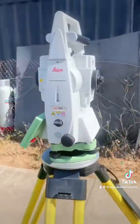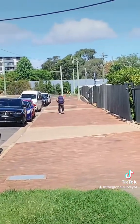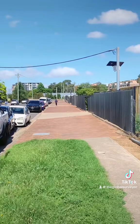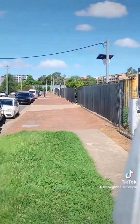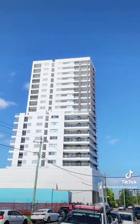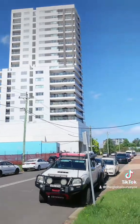To do that, we're going to have a tripod about 100 metres away down the end of the street there, so I can adjust the ATR — automatic target recognition — and the horizontal collimation on this TS16. And then we need to find something taller like this building, which I've used a rivet towards the top of the building so I can adjust the vertical collimation.